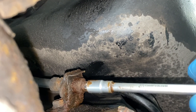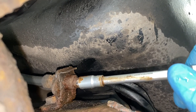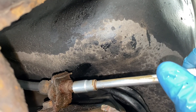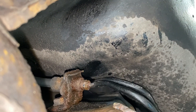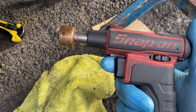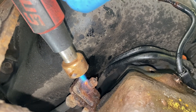I suspected that nut was once an 11mm or 10mm — I can't remember. 10mm doesn't fit anymore because it's corroded away so I knocked a 9mm onto it, but it's still not undoing because it's really tight. So the next thing is going to have to be carefully applying a little bit of heat, whilst remembering that we are right next to a fuel tank, so be very very careful.